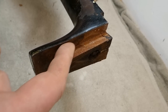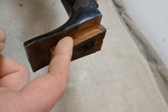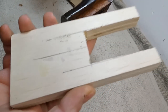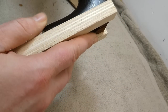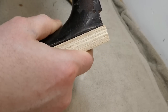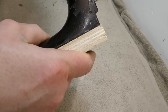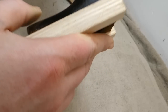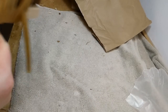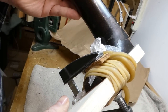The inside of the heel surface is all end grain, so it's very absorbent. I'll paint it with some hot water — boil some water, put it on there — and clamp it flat. To do this I made a little block with a cutout to accept the dovetail. I'm going to use surgical tubing to wrap it up and do the clamping, because it's pliable — nice where you've got a curve — and it's very strong if you use a bunch of wraps. That should press that bit of warp out. I'll put an F-clamp on there as well, just to hold the tubing in place.